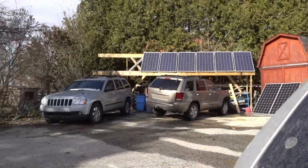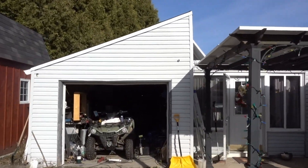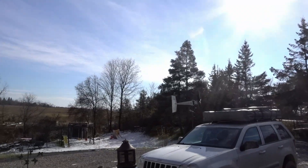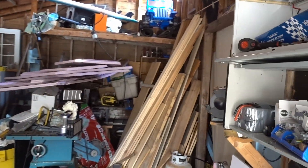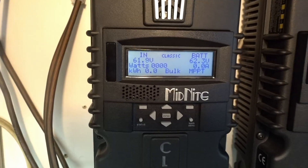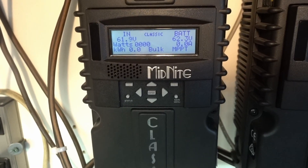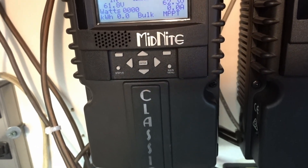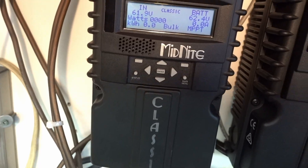I'm not sure if it's making power right now, but by the time I get inside that wind will be gone almost for sure. Still spinning — but it probably won't be spinning enough to make power by the time I get in here. Yeah it's already slowing down. Looks like it's still spinning but it's just not going above my battery's voltage — it's got to be above that. Sorry about filming — trying to move my key so I don't touch it to my batteries, that would be very bad.